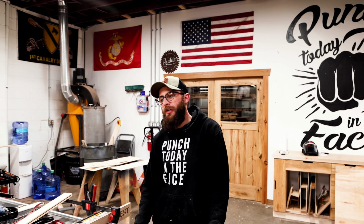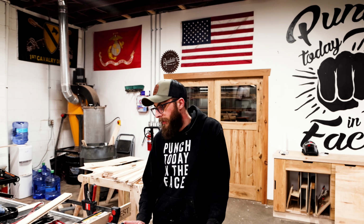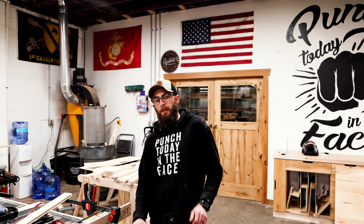This shouldn't be this hard, but apparently it is. We started gluing these things together. I sort of rushed it last night when I was running these through the shaper after we had to recut them, and they all ended up a little bit too thick. Fortunately, there are a hundred ways to do these kinds of things. So I set up a dado stack with a sacrificial fence and a crosscut sled. We can just skim off these tenons a little bit, make this glue-up go a lot easier, and hopefully get back on track.